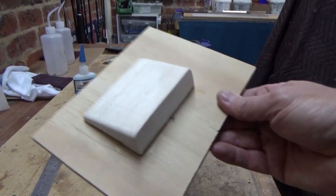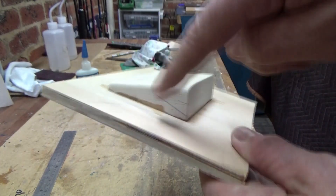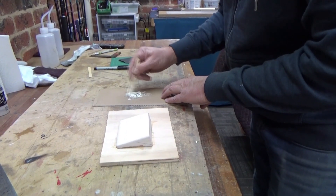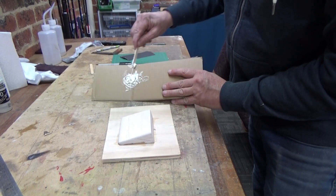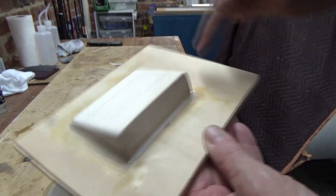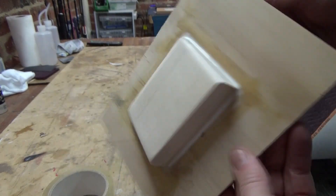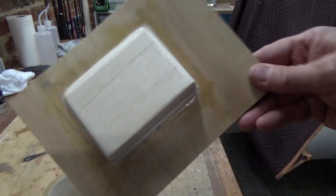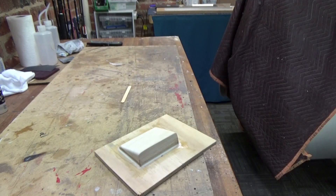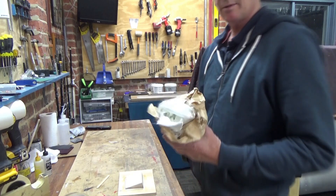There's the first blank. I drew two lines on it, made a mistake - that's alright. I'll taper this down so it'll be a tapered box. There's a couple minutes work - there's my mold. I'm going to mix up some filler and run a finger fillet all around the edge just so it'll release nice. And there's the mold ready to go - literally a finger fillet around there. Lick your finger, or put a glove on, dip your finger in something and whip it around. I'm going to use Sellotape as my release agent, a la Mark Patey. I've got some four-ounce cloth - that's what I had in the cupboard, so that's what I'll use.